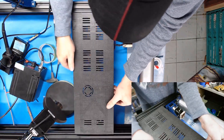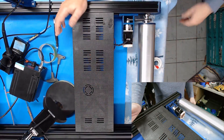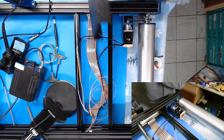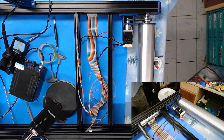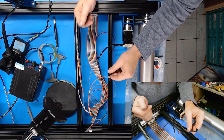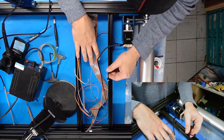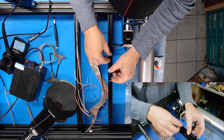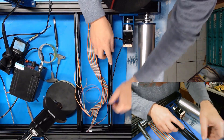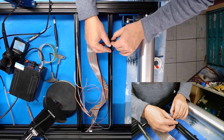So you can see how it's going to look — that's basically how the wiring will go. Now we will go ahead and use the three-wire to two-wire adapter out of our Noctua fan box and splice it into this one here, which is our power for our fans. They're going to mount in our bottom cover. We'll split that off and run one more feed over to here. All this will tuck nice and neat down in the tray before we close it all up, just like that.